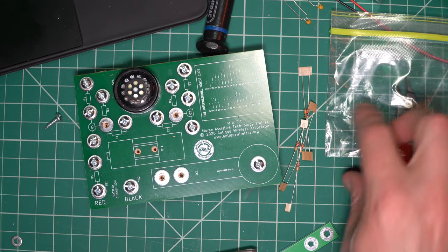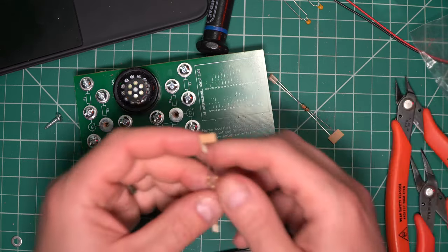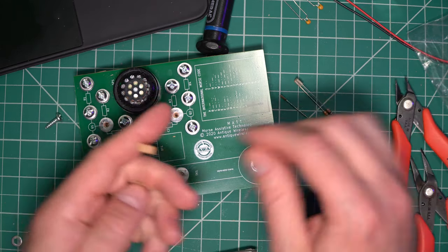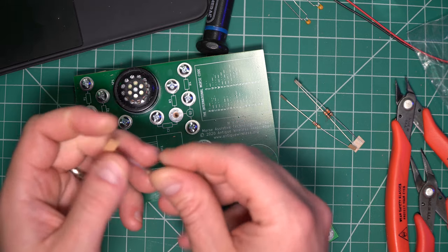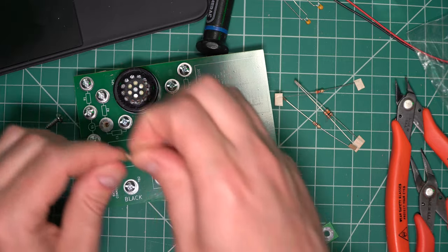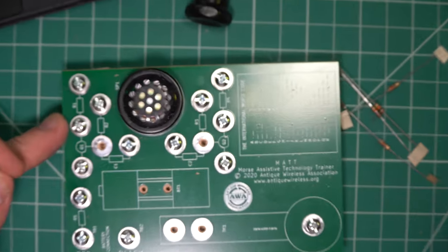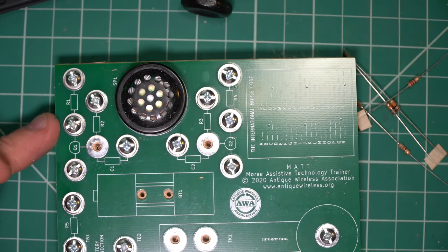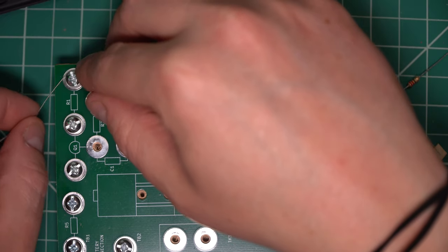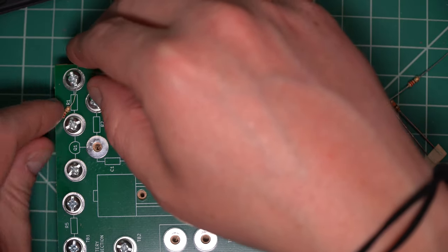Okay. First resistor is red, red, brown, gold, which there are 2 of those. Pretty easy. I don't even know that I can screw this one up, guys, but keep watching. Maybe you'll get lucky. All right, so I'm literally just following the PCB diagram here. I'm going to lay it out exactly as it defines it. So the instructions are that the wire is supposed to go underneath the washer, which is what I'll do.